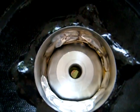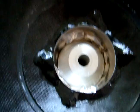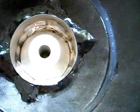But you can see the coil here. Now what happened was it bottomed out. I know a lot of you guys are going to say, oh, you can't bottom these woofers out. Well, on this particular Recone, the coil was longer than the stock one. I noticed it. I sent an email to Jacob. Jacob said it would be fine. Go ahead and put it together.